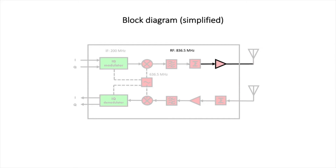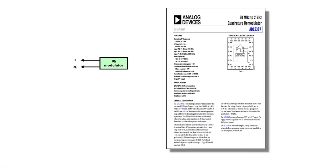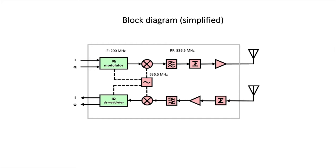The BGA 616 is a cascadable 50-ohm block amplifier that can amplify from DC all the way up to 2.7 GHz within 3 dB. Now we've seen the full transmission circuit, and the receiving circuit is pretty much the same functional units in a different order: attenuator, amplifier, bandpass filter, mixer fed from the same frequency synthesizer, and the IQ demodulator — also a device from Analog Devices commonly used in GSM, 3G, and wireless LAN applications. These are the most important parts; there are actually more parts of the unit, some of which I'll talk about in this review.